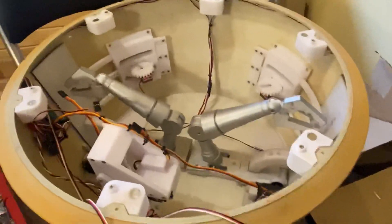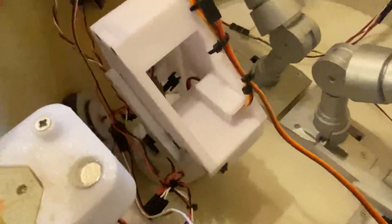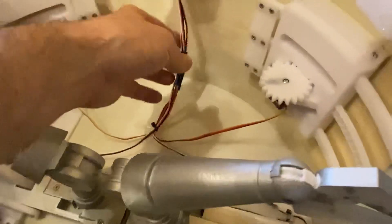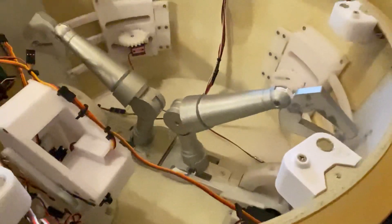Once you get used to it, you can start to route your cables and put connectors on custom-length cables. I'll show you where we are with the chopper dome build - you can put connectors on wherever you've run short. In this case there's a wire loom that goes all the way around the outside, and if I've got a faulty servo, I don't have to do any disassembly - I can just disconnect a single connector and replace the individual servo. Really useful skill, highly recommend it.